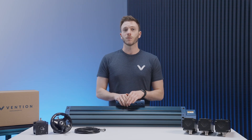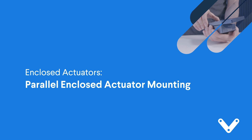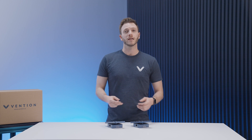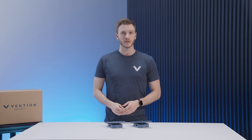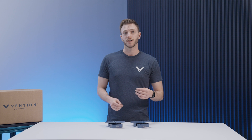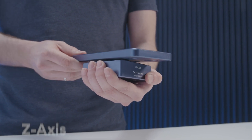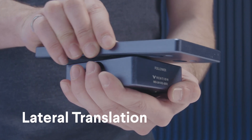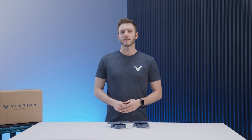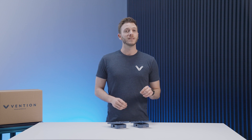To close off, we'll be taking a look at what hardware is needed when you have two parallel enclosed actuators. Over here we have the mounting plates designed specifically for attaching two mechanically joined enclosed actuators to a structure without the need for high-precision tools. These mounting plates are used in pairs, with a leader securing one of the parallel actuators and a follower securing the other. They each have rotational degrees of freedom around the X, Y, and Z axes, as well as an additional translational degree of freedom for the follower. This prevents the development of internal stresses on the bearings, even if the axes are installed with a few millimeters of misalignment. It should be noted that once the assembly is complete, the system does become fully constrained.